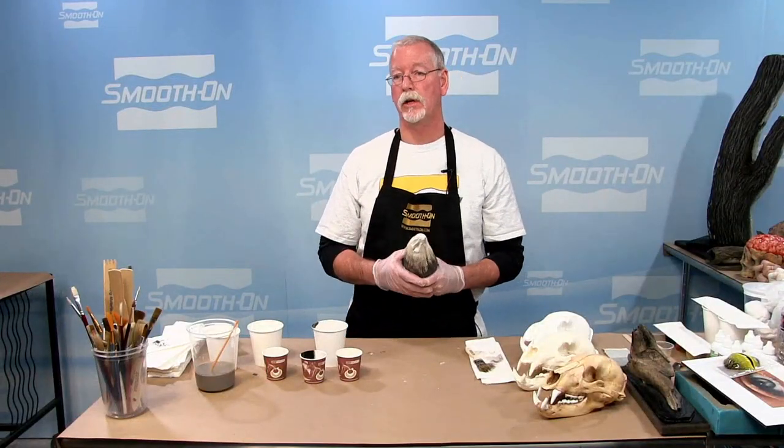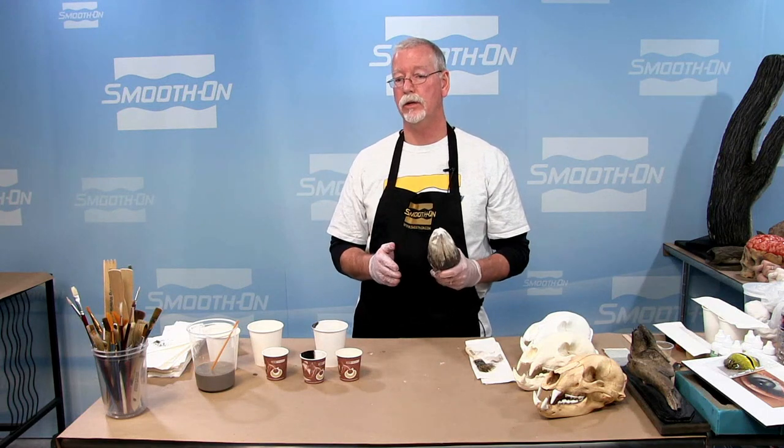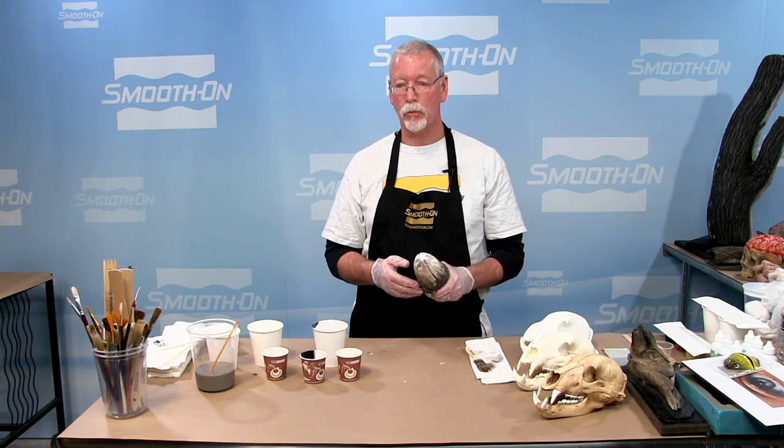If you're doing a bigger piece with the acrylic paint, I wouldn't recommend coating the whole thing with the acrylic and trying to wipe it off then. Acrylic dries pretty quickly. You could really darken that piece, and then you're going to have to go opaque lighter to rework it. So do sections at a time, and you'll have more control.